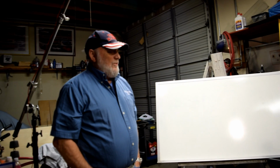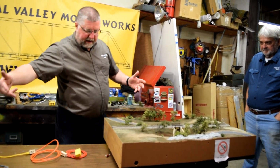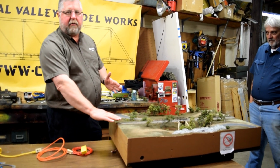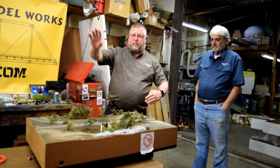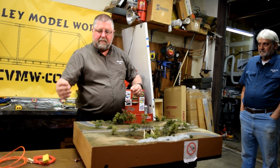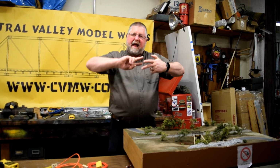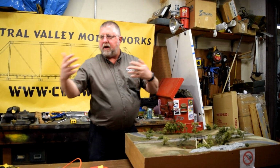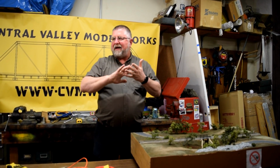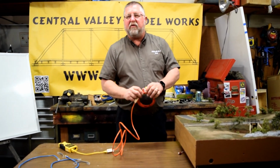The question is, why do we do this? The way the system works by crossing over, when I look at it from this end, the local track is on a certain pin, and the next two modules down the line are on two other pins when I'm looking at my detection. When I look from the other end, I want that same thing to happen going the other direction. So that crossover makes sure that looking this direction, I'm always seeing a mirror image of what I'm seeing in that direction, because what was advanced that way needs to be a different spot here. It's confusing, and I don't want to go into all the details, but trust us that that's what has to happen. The simple answer is that it's what lets us turn modules around freely. That's what makes the modules reversible. They're all mirrored. Having an odd number of crossovers makes the module reversible.